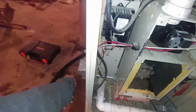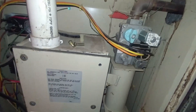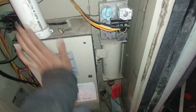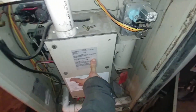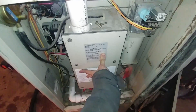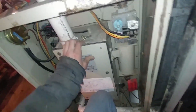So we could light it up again here. Main blower. Little blower. And in order for it to pre-purge properly, we've got to hold this on there so that it can actually get air pushed through the heat exchanger. I'm not sure if this is a 30-second pre-purge or what it is. It just clicked off the main blower. There's the igniter, and the gas valve opened — now it's lit again, so we can take this back off of here.